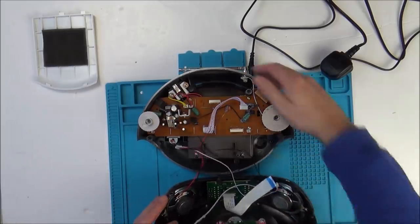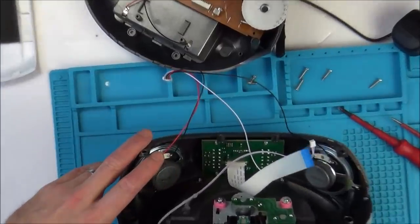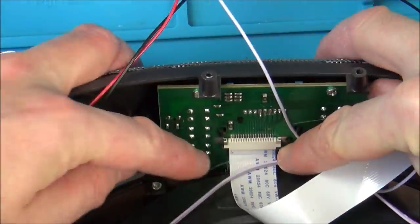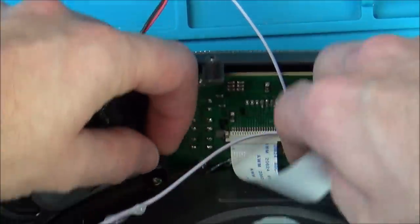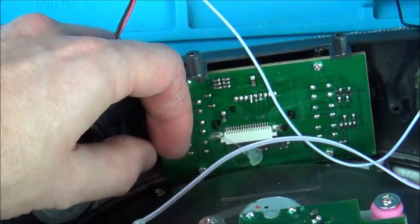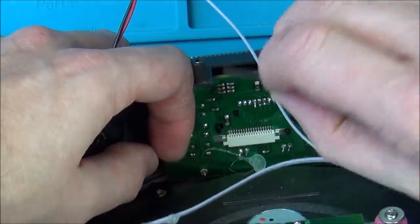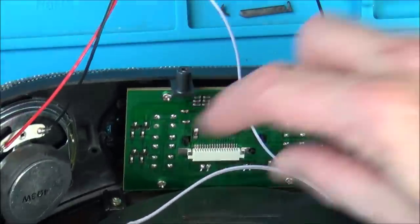I wonder whether this side has been done correctly or not. So let's take this ribbon cable out. So there's two little tabs that we just have to push back. Here and here. Oops, that's come right the way out, so that's not good. No, oh, that's snapped. That's snapped now, so I'm going to have to do some work on that one. Should be okay though, because I can put that back in with the other side, wherever it's gone here, and I can just use a bit of glue or even a bit of tape over that, so that should be okay.